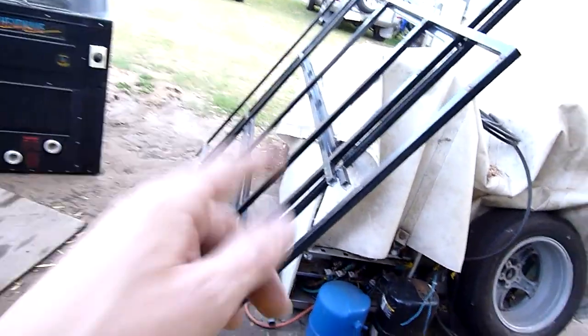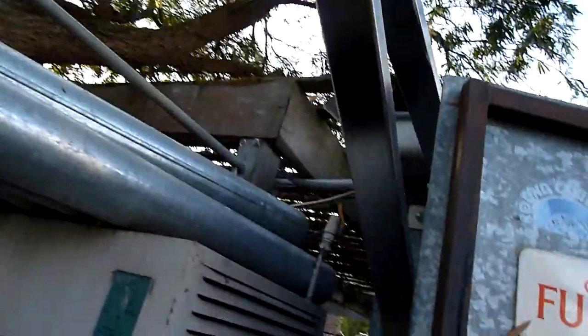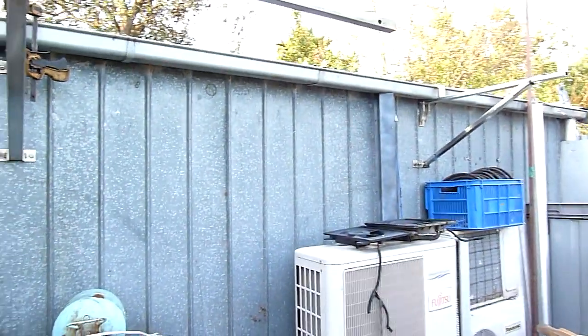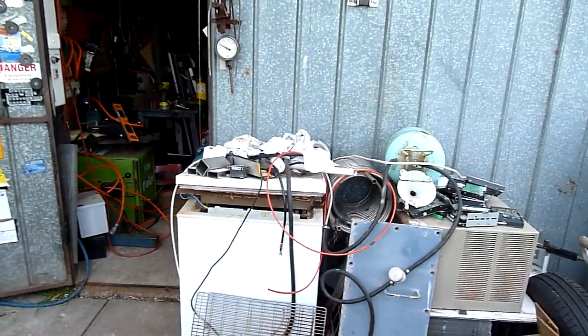As you can see, the welder's near the door for good reason — I've been putting more brackets up, including one up there which still needs more work because I have roof structure. I'm going to put up an annex of sorts, or a veranda roof. They are very strong — this one here twists a bit to the side because I'm not done welding reinforcing in yet, but as you can see they're cantilever brackets, meaning no posts across here, which is awesome. It's going to be three wide — three frames going width-ways — with a slight fall back to the gutter. I've got to get up there with the shop vac and suck all the debris out of that gutter before I put anything up.